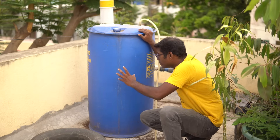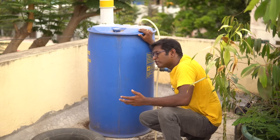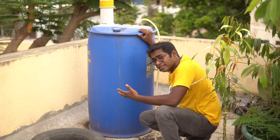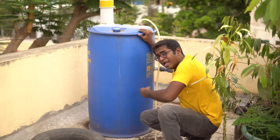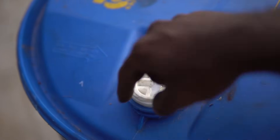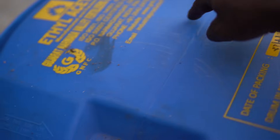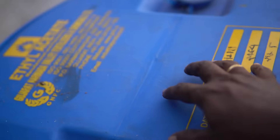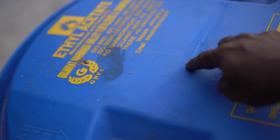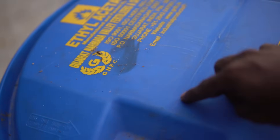This barrel is the digester of the biogas plant — all of the waste goes inside and gets digested, producing slurry and gas. The PVC pipe I'm using won't fit near the seams because of the barrel's shape. Sealed barrels should never be drilled on the seams — they are heat-welded and drilling holes will destroy the structural integrity. So the hole, about 4 inches, will be placed slightly off-center toward the edge.